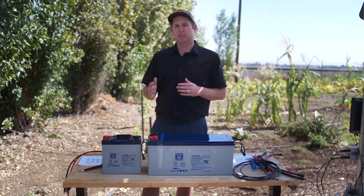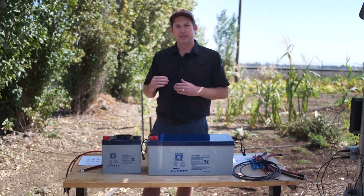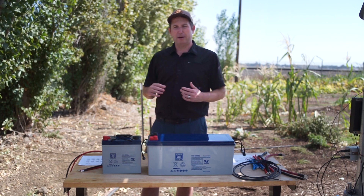One of the great things about these battery bank systems is you can start with a smaller battery bank, and if you find your usage a little higher than expected you can add additional sets of batteries in parallel to increase the capacity of your overall system. So let's jump in — we'll start with the small batteries and show you a 24 volt and a 48 volt connection.